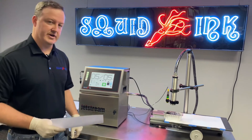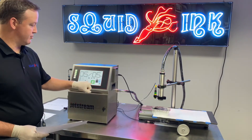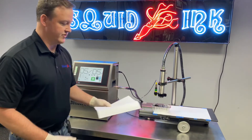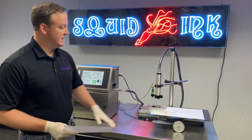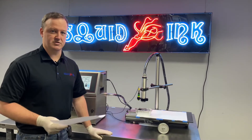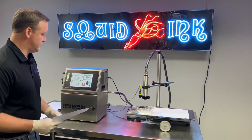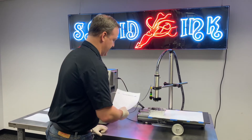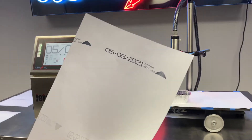This message is set to auto print, so I'll just give you a quick example of a print test. When we hit print, it's just going to continuously print and we'll run a sheet of paper under the head. Now, we're doing this by hand so distance isn't going to stay perfect — that's okay. General rule of thumb, if we're about three quarters of an inch away from the printhead, we're going to be able to see what we need to see as far as print quality is concerned. So if I hit print, the system is just continuously printing, and if we pass our sheet of paper under the printhead, we can see what it's doing.